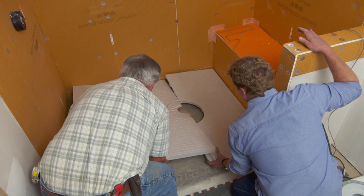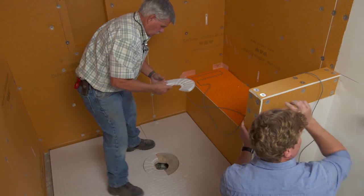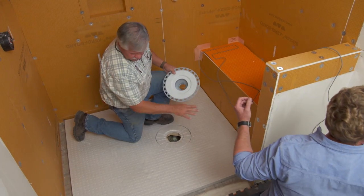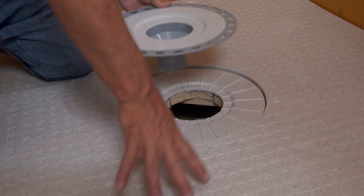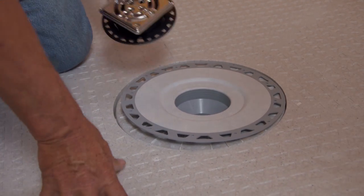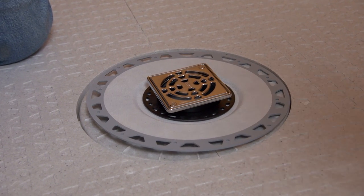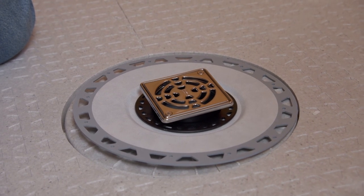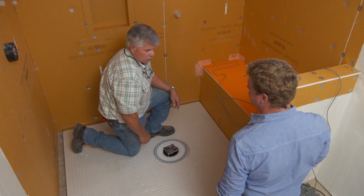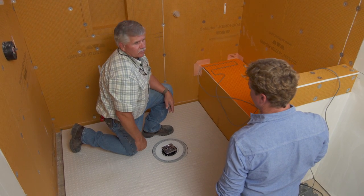The foam floor panels are already tapered, which is great — the old-fashioned way required a mud job and a pan. Once you've glued everything down with thinset and set the drain with PVC cement, your drain is waterproof. The square drain cover saves the tile guy a lot of work — cutting straight is always easier than clipping a circle. The floor will also get the same radiant heat wire system, and with everything waterproofed and taped, you'll have a heated floor.